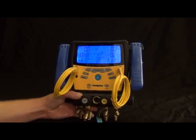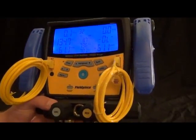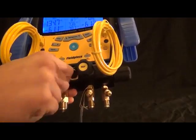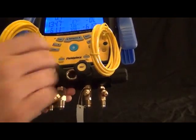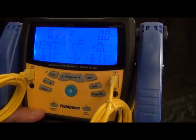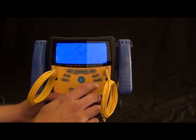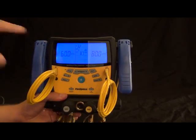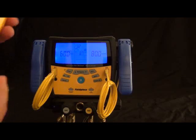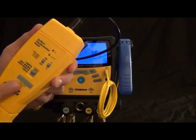The S-Man 460 has the exact same display as the S-Man 300. In the target superheat mode, I can send a wireless measurement directly to the S-Man. I have a default measurement set up, so I'm going to sync up our transmitter. With the transmitter hooked up and turned on, connected to wet bulb — this is our ARH-5, which measures wet bulb with a thermistor. I'll press sync on the S-Man, then press sync on the transmitter, and you'll see it pop up in just a couple of seconds.